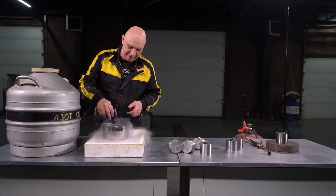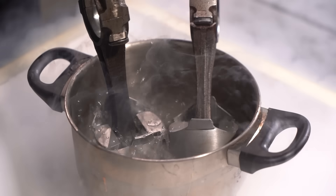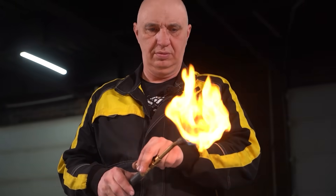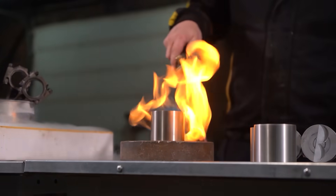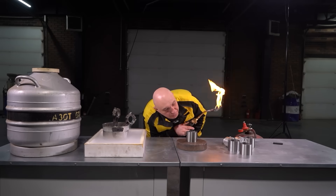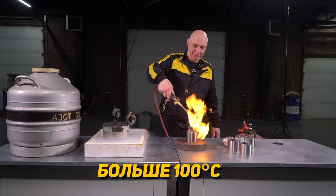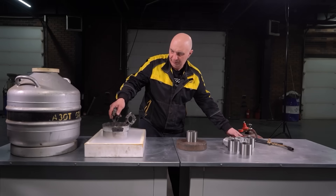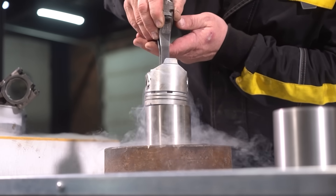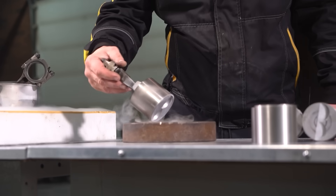We put the first one in, then the other. We quickly put some heat into it — should have heated the metal slab, as it's going to pull heat from the casings. You can spit on it to check: if it bounces off, the temperature is above 100 Celsius. That went very well — that is one done.